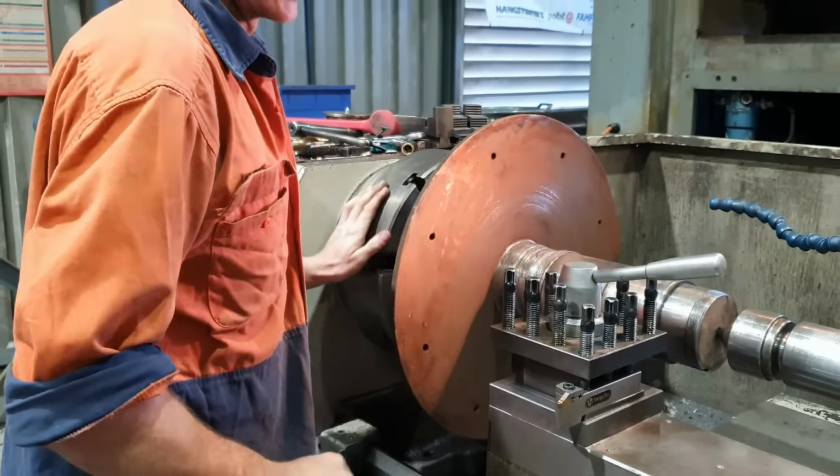How you going, guys? Curtis from Cutting Edge Engineering. Today's job is an auger drive from a cardboard compacting unit. Customer called me a couple of days ago and said he has a shaft about 130 mm diameter that has a worn area where the bearing has locked up and damaged the shaft. I figured that'd be a good candidate for a spray welding job.